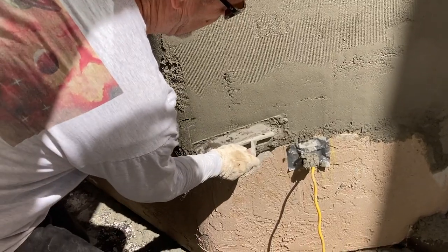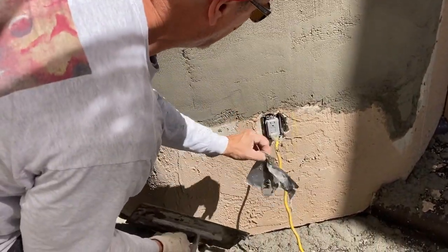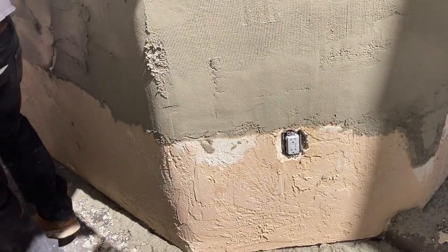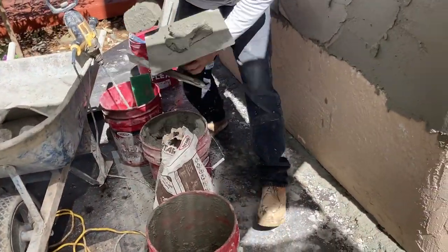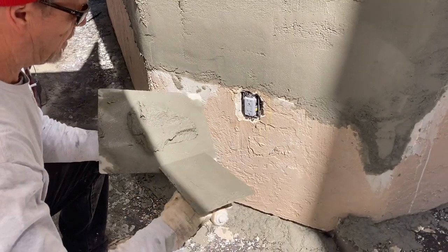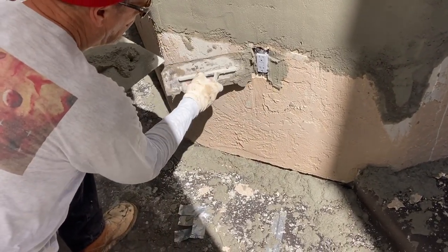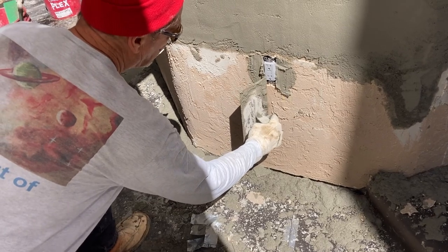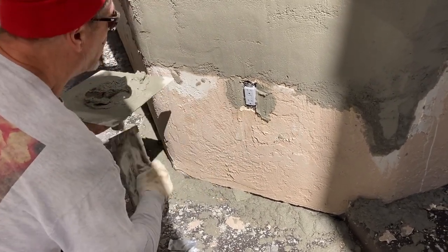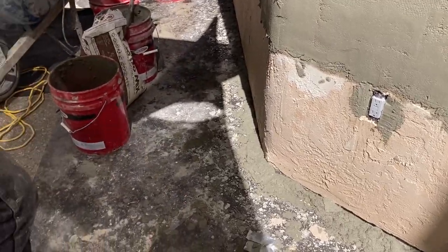After this takes up a little bit more we can screed our edges to make that uniform across the top and same thing on the bottom - keep it straight all the way up. It's a little more dry right here because the finished plaster had scraped off. Then we're going to float that in about 10 minutes - at least trim it out. I still have to do the light box here, and we've got to get that patch around the corner too. We're going to go ahead and finish plastering this.